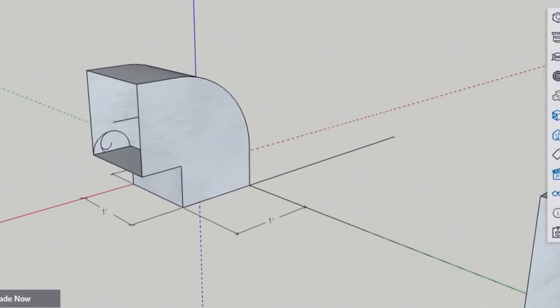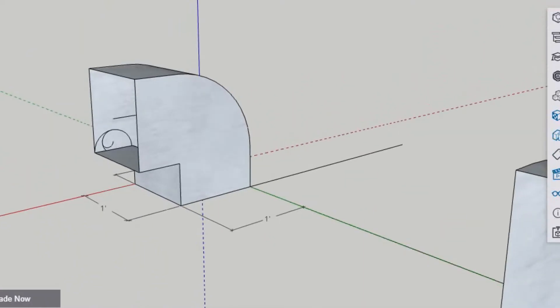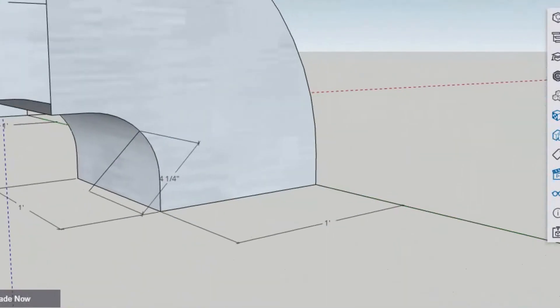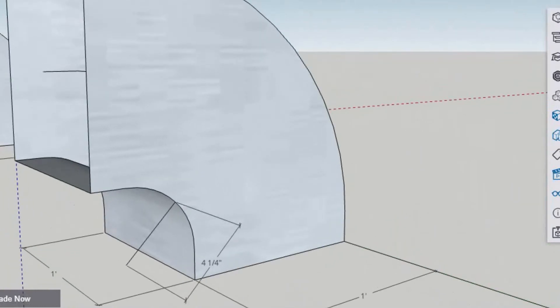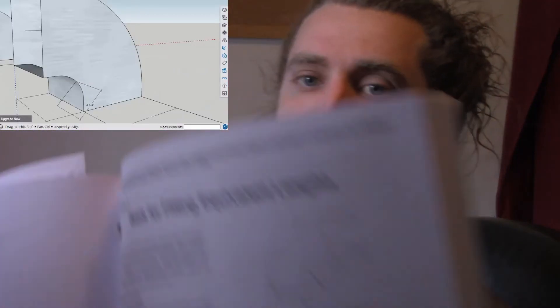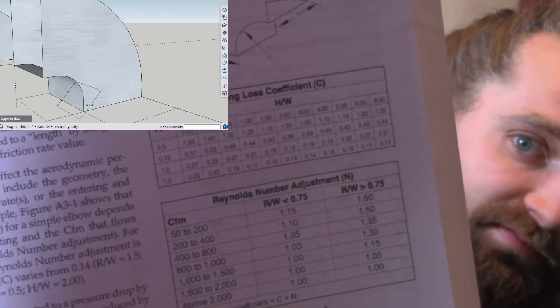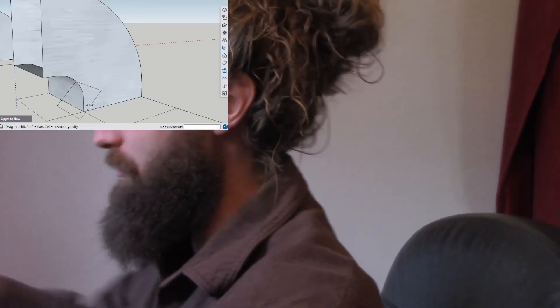When we're looking at that first fitting with the hard 90, we've got a pretty turbulent eddy in that horizontal section of the duct. When we come to something with a nice radius, there's a less likely chance we'll have a lot of turbulence, so the Reynolds number associated with that would be lower. In the Manual D book we've got a few different charts - we've got our fitting loss coefficients and also our Reynolds number adjustment.